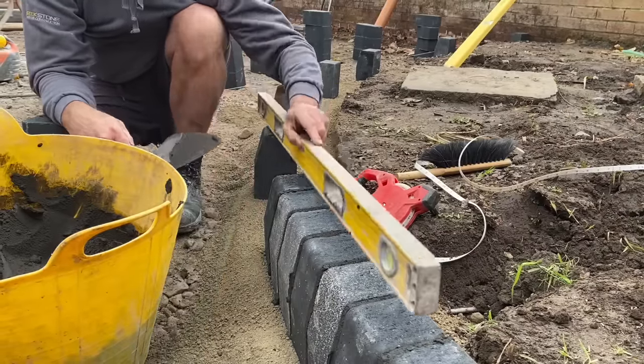Okay, so there's 4 things going on right now. We've got a man on the roller doing the main areas, someone on the whacker going around the edges, hard to reach areas, and then right up against the building and edges, we've got someone on a hand tamper while also keeping the surface damp and moist so we get maximum compaction.